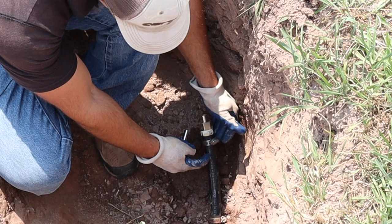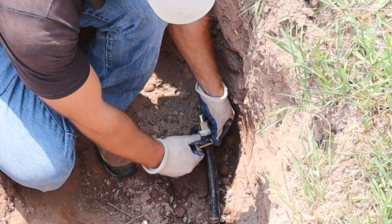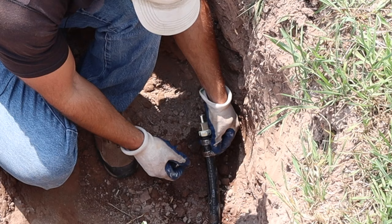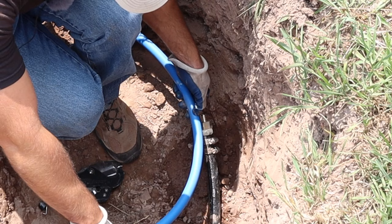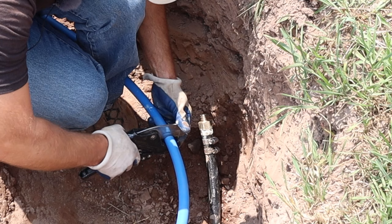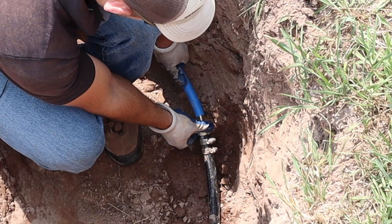Since the barb piece goes all the way down here, space the clamp rings about half an inch from each other. It's very easy to strip out these clamp rings, so don't over-tighten. If at any point you don't feel confident doing a job like this, always seek a professional. Now we need to connect the PEX pipe, so cut it off at the appropriate length — right here looks about right.